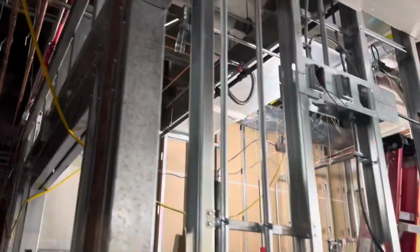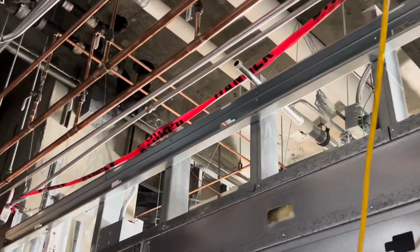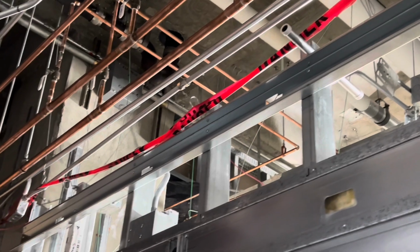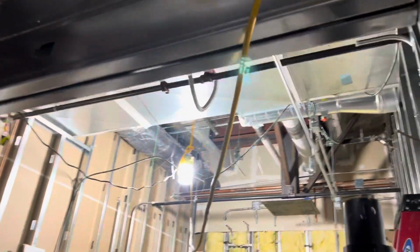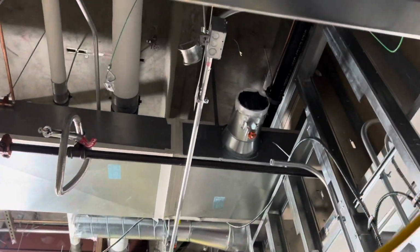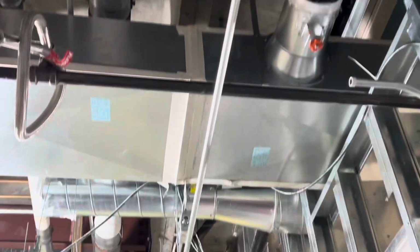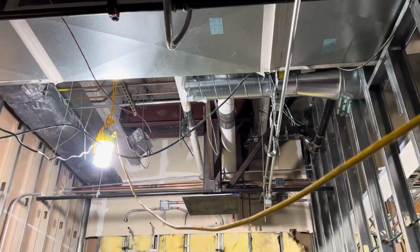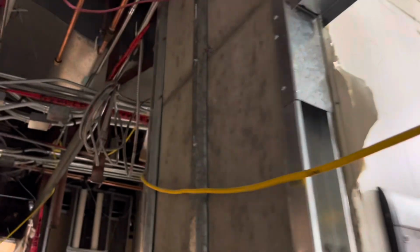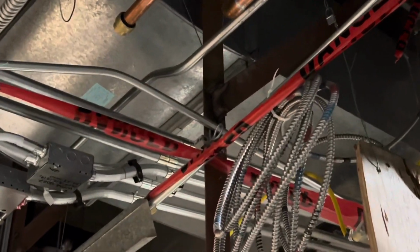And over here we got some more bridle rings on the studs, this time with the beam clamps onto the studs. You can kind of see the hooks up there. And then we got these ones on some all thread right here, with beam clamps again, using the middle notch because otherwise it won't grab. But I figured that out on the second one, so I fixed the first one, and then raised this beam clamp up from that spot.